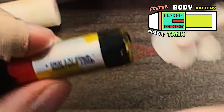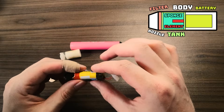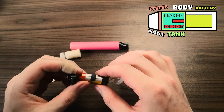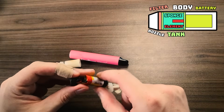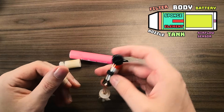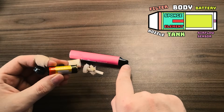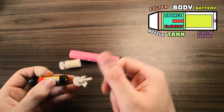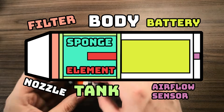Here we have a 13400 form-factor lithium-ion cell. This thing is rated at 3.7 volts nominal with 2.04 watt-hours of charge storage capacity — it's a pretty beefy little guy. It's very slightly smaller than a AAA battery, and these fetch a pretty decent price on eBay. So even if you're not interested in actually reusing the vape, stripping out the batteries and selling them online is a pretty good way to recycle these things. Finally, this is connected to an airflow sensor at the base — in this case it's glued onto the bottom, though in some other models it's actually loose. As you pull air through the vape, this will turn on, close the circuit, dump a bunch of energy into that coil, which will heat up the juice and send it through into your mouth. There's no fans, no pumps — it's completely analog. It's a very ingenious little system.